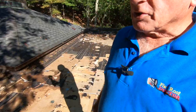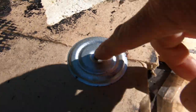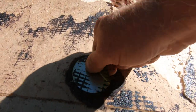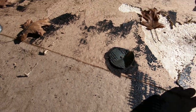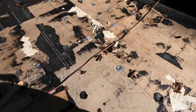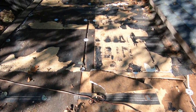Not hiring the right person or getting somebody cheap — I think the guy did it very cheap. He used these plates with sheetrock screws, and then to save more money he used these little plates with nails. I can pull this nail up with my hand. With roofing, that's not the way to do it. Every now and then he puts this plate, which is good, but then uses nothing — this is a horrible situation.